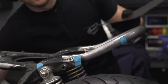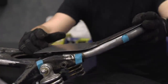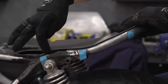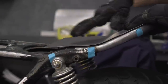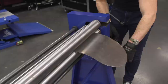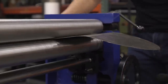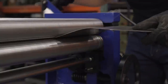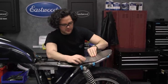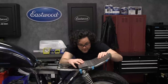Let me get the seat out of the way because it kind of butts up against it, but for a first pass, can't be upset about that. So we're going to get some lines down for this lower radius we have to make and do the same thing to follow that curve as well. I was a little aggressive with the slip roller, but that's okay — I kind of like to adjust these by hand, at least when you're working with thin sheet metal like this. I'm happy with where that sits.